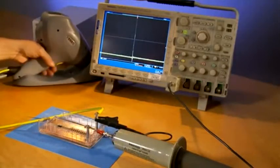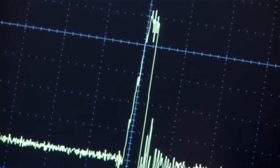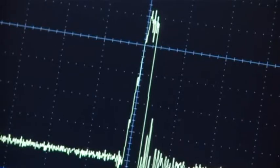As you can see from the sharp drop in the output voltage, the surge broke through the silicon dioxide and dumped the charge from the tester. Even though this product is rated at 5 kV RMS, its inability to pass this 10 kV surge test suggests that it would not be able to meet the IEC 60747-5-5 requirements for reinforced insulation.